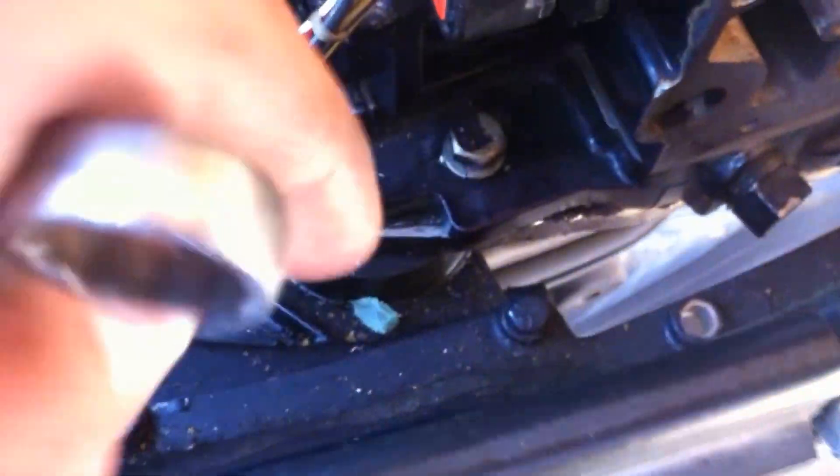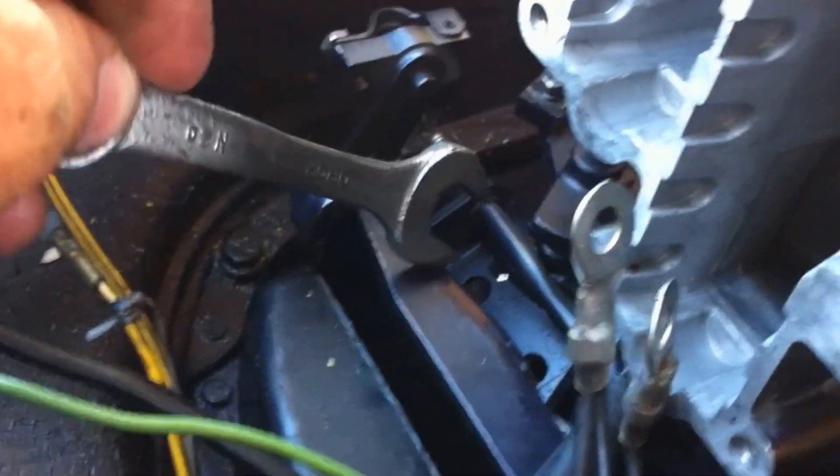One of the challenges is getting down these little tight spaces. You can see right down here I've got to tighten these big bolts that hold the power head on. Some of them you can reach fine, and then there's others that you reach from underneath and put nuts on. In order to get some of these, I don't have one of those nice universal ratchet extensions that can spin, so I've taken a wrench and just bent it out of shape so I can get especially these ones that are underneath — just because it's a little tricky with this part of the frame in the way.